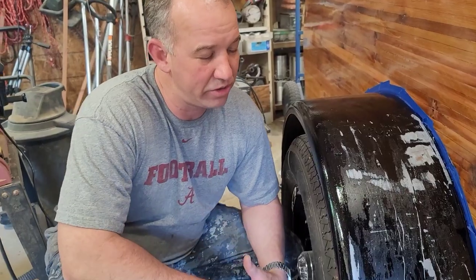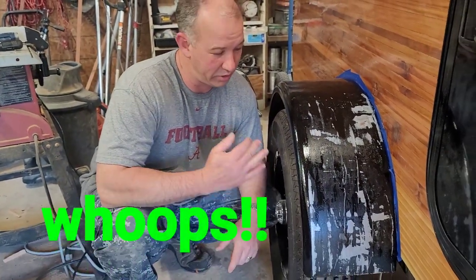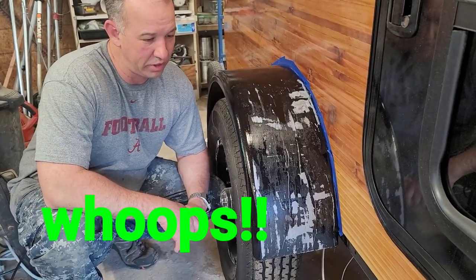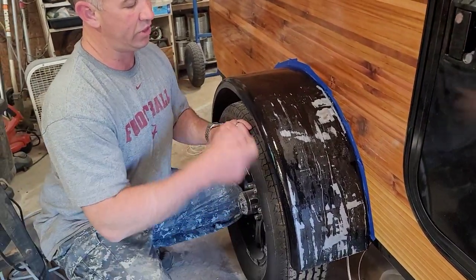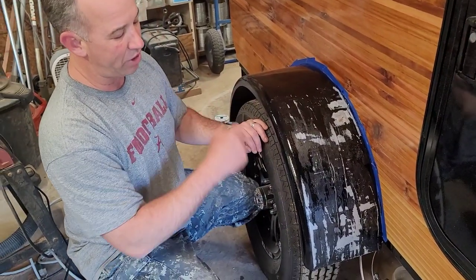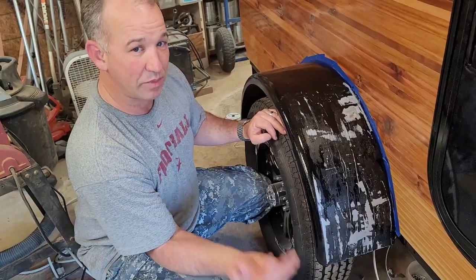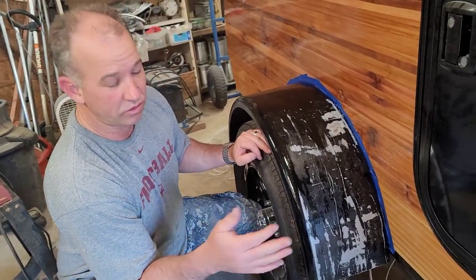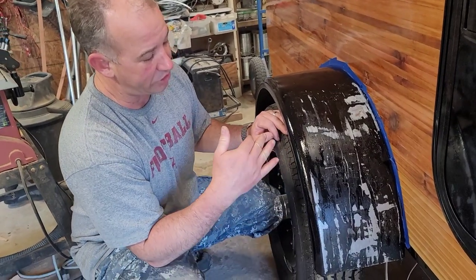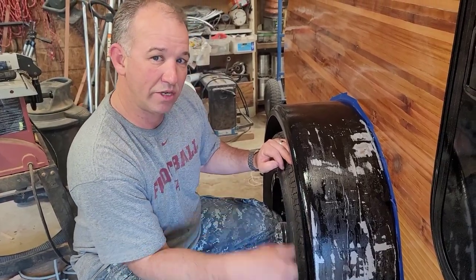The automotive-quality urethane clear coat on this paint caused it to bubble, so we just went through and scraped it off. Generally I would put it in an air hose and do a fine mist spray — that's what I've done with auto body work in the past. This time we brushed it on and it bubbled up, so lesson learned: scrape it down, give it another sand, and put the black paint back on.